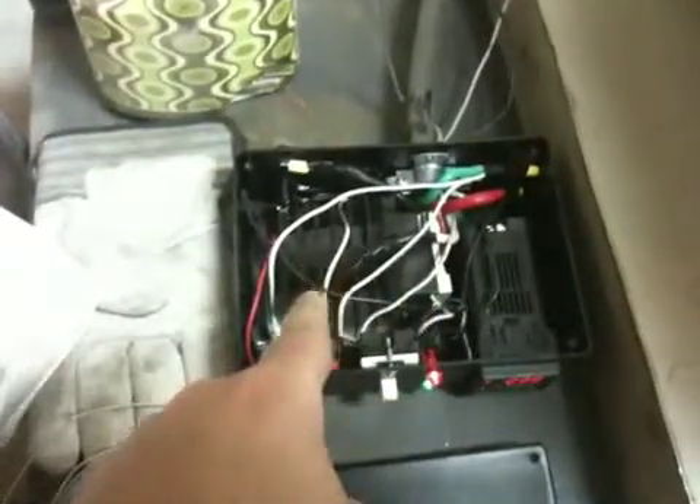I can go ahead and open this top up to show you the wiring — not too terribly difficult. I got a couple fuse holders in the back — one fuse for the heating element and one for the temperature controller, just in case. And then I got a solid state relay in there. That's what controls the switching on and off of the heating element — the low voltage side is tied to the controller and the high voltage is tied directly to the 220. That SSR is connected to a heat sink, because those things get real hot and without a proper heat sink they'll self-destruct, short out your heating element, and it's a big mess.